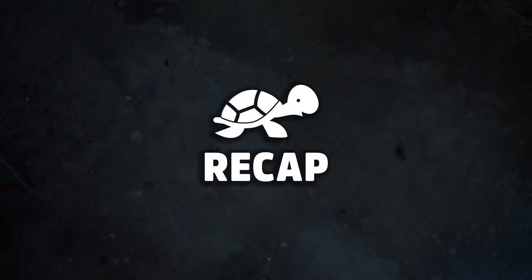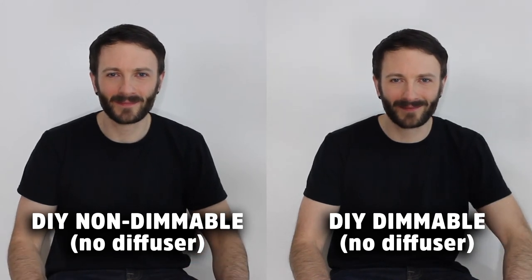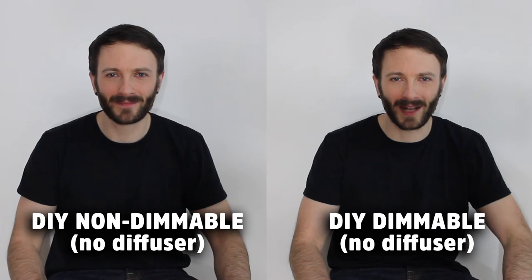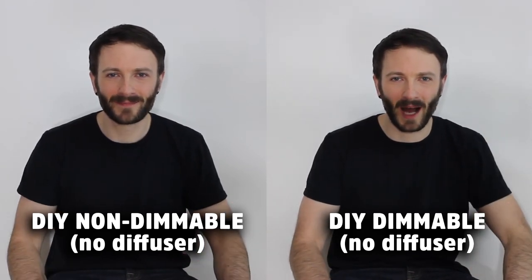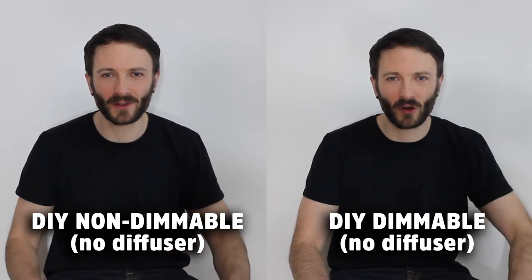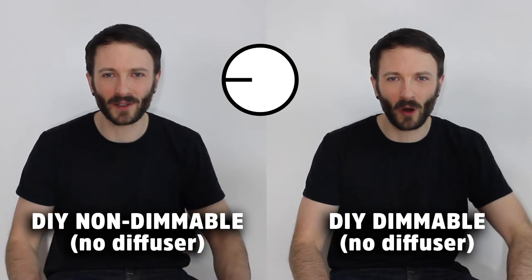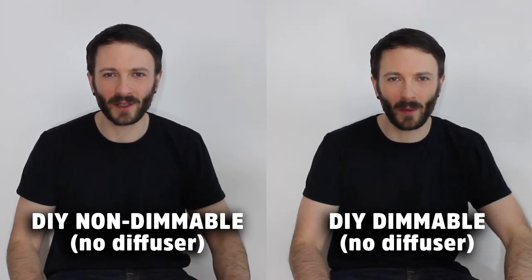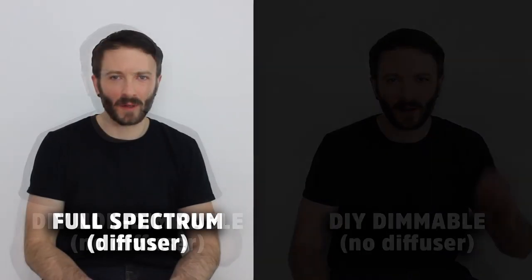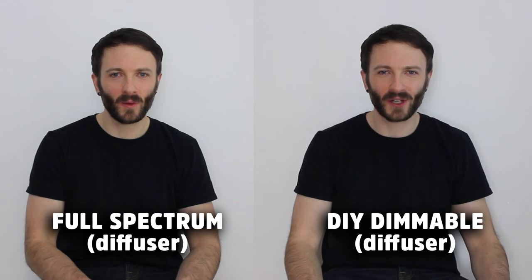Catch all that? Let's do a side-by-side recap. Here's the non-dimmable DIY version without the diffuser, and here's the dimmable version turned down just enough so the strobing stops. It seems like the dimmable version is slightly brighter — I'd actually expected it to be a little less bright because of the dimmer switch. I used two different tripods for each light, so I'm guessing the position might have been slightly different, yielding different results. This isn't a lab-grade experiment so I'm going to consider the two versions equivalent. In addition to the strobing effect, the dimmer has a really narrow adjustment band — maybe about a quarter turn worth of adjustability. Since the light isn't obnoxiously bright on full power, I don't even think the dimmer is needed. If you do find yourself with too much light, you could always just unscrew a bulb.